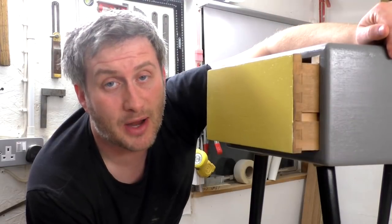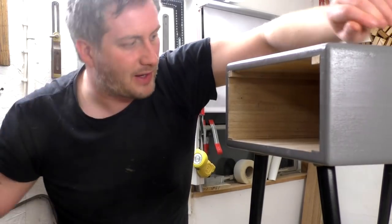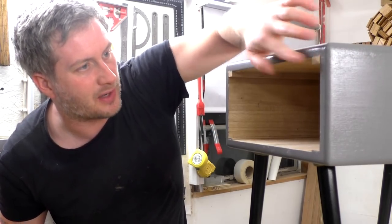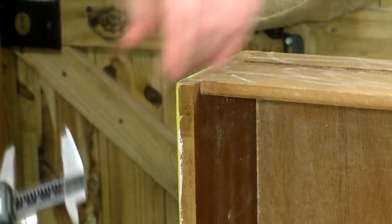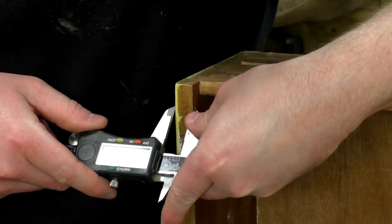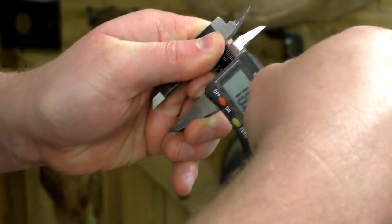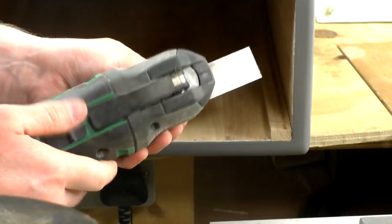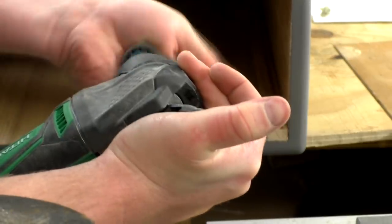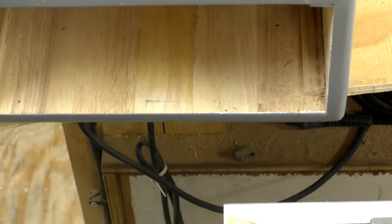Oh dear. Some of you probably already know where I've gone wrong here. I designed this unit so that the drawer front would sit inside, but since then I've added these drawer runners and obviously they're flush with the front, which means that the drawer front won't go all of the way in. So now I need to figure out how I can trim off these drawer runners. I'm going to use my calipers to measure the thickness of the drawer front — that's just over 15mm. So I'm going to set the calipers to 16mm and lock it down, and now I can scribe a mark where I need to make a cut. And now I can see if I can get in here with my multi-tool. Now I've just got to do that three more times.